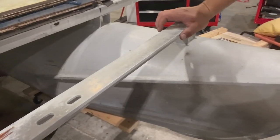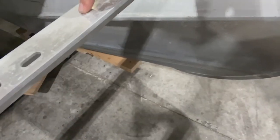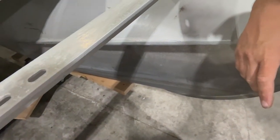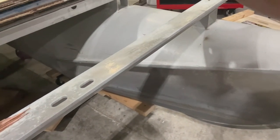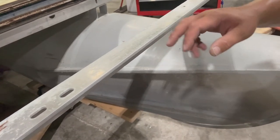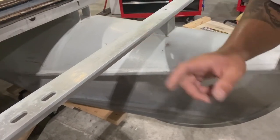This boat's 25 years old and it's been in fresh water. Treated wood has sat on this aluminum, and that is the extent of the corrosion — it's like a hundredth of a millimeter of pitting. That's going to take decades, centuries, 500 years or something like that to wear through. If you're in saltwater or a marina where there's electrolysis happening, maybe faster — but it basically just leaves a white residue and very minor pitting. Not something I'm concerned with in terms of this boat lasting another 25 to 50 years or more unless taken to saltwater or some sort of weird corrosive environment.